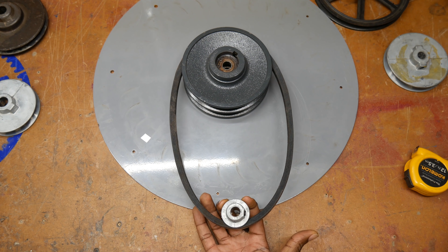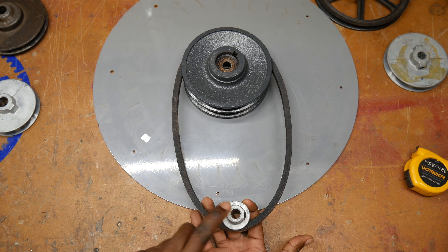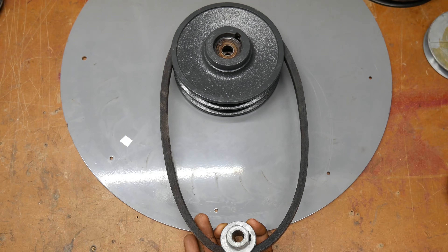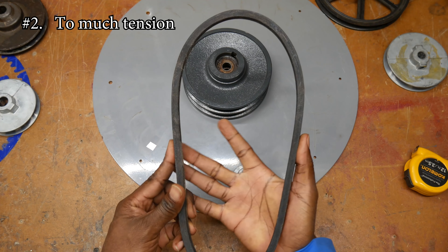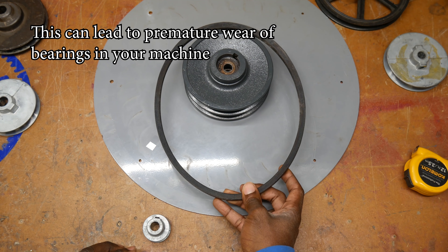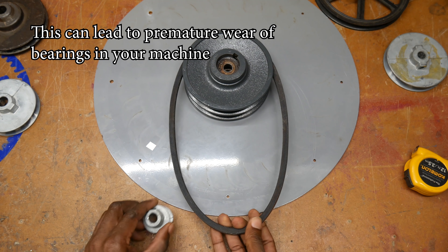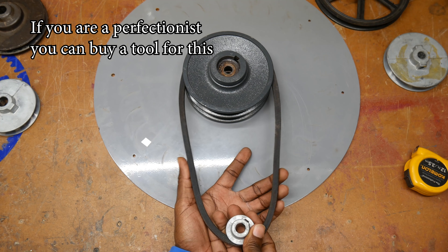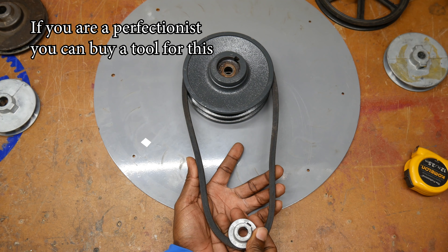Designing a machine with a very small pulley means that this pulley is going to slip. When it slips, your first temptation is to say your belt is not tight enough, but making the belt tighter leads to a different problem. You don't actually want your belt to be that tight. The best way is to have it snug with just a little bit of slack — you should be able to flex the belt just a little bit.